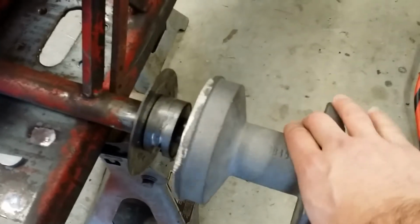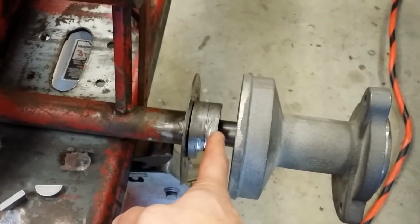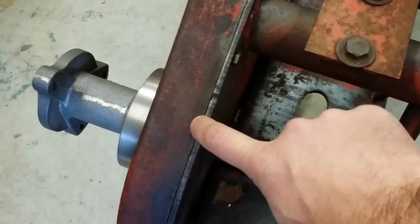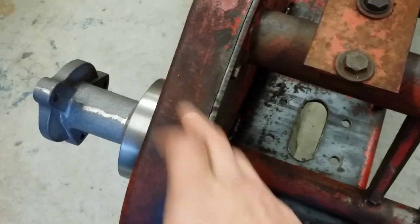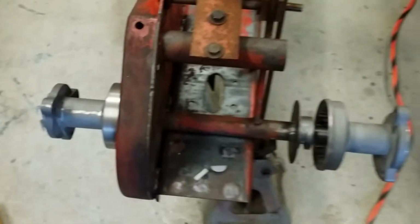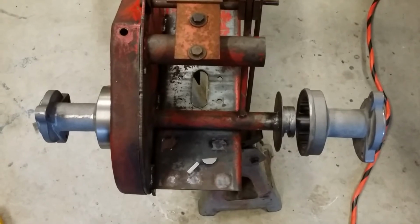And the reason for that is because I'm going to justify off of this backing plate or the end of this axle tube. I'm going to measure from here to the inside. I'll take the gear case cover off, the inside of the axle shaft, and make a mark. That's where the big iron gear is going to get welded on. So that's what we're going to do next. We're going to do those marks. We're going to weld that gear on.